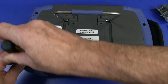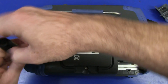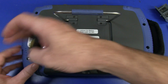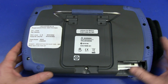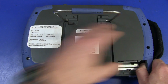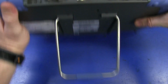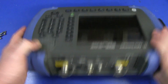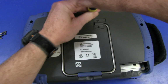Most likely run some sort of embedded OS, but yeah, not too fussed. What we want to see is inside the RF cans, of course. They'll be all fully machined cans with RF shielding gaskets on them, and we will see lots of PCB component technology as well, lots of inductors and stuff embedded into the PCB, and capacitors and various components and bandpass filters and things like that, all embedded into the PCB, which won't be a regular material. It'll be special controlled impedance, and it'll be very, very nice.